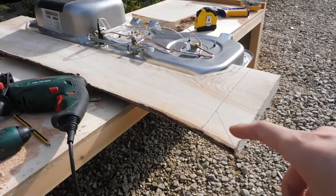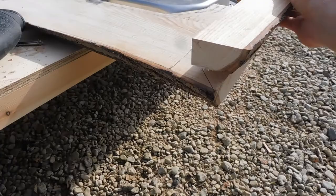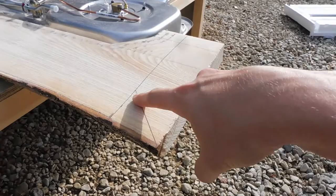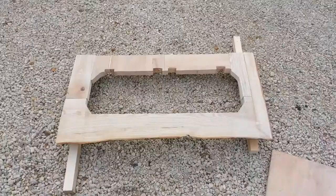The new kitchen top is underway. What I did was I found a nice bit of old wood — a big plank that we had — and I'm going to make this the surround for the cooker. I'm going to add this so that even along the edges there's all the bark, because I really like the edge of this bark, it looks really nice. So I'm just cutting a little 45-degree angle and then putting that in there, cutting another 45-degree angle, and then start putting it all together and creating my worktop.